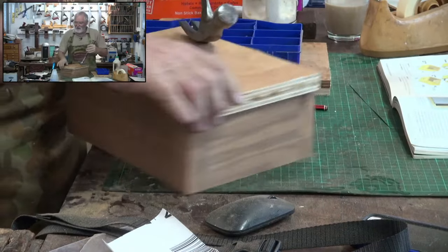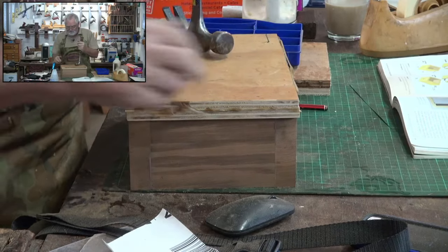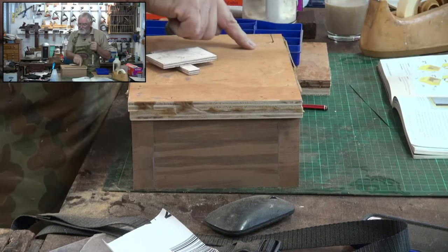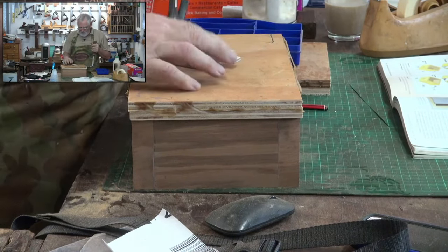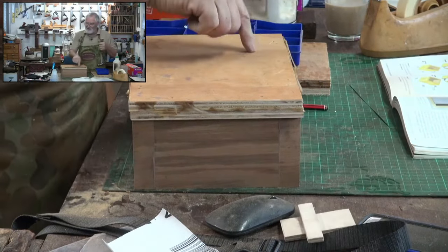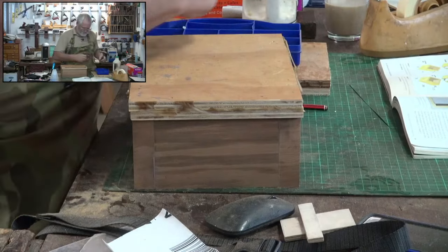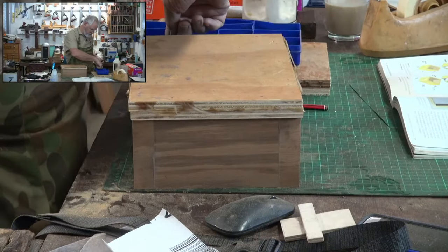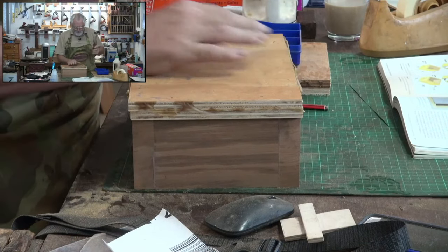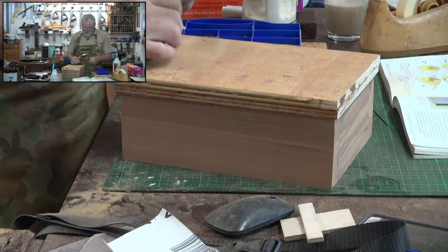If you are in a situation where you've got a bent nail and you've got a finished surface, instead of using your claw hammer and pulling the nail out like that, you're going to bruise this part of the timber. Get a bit of sacrificial timber underneath it, then ease it out, and that'll keep your surface nice and unblemished. I'd like to know how those nails got in there, because anyway. There we go.